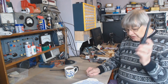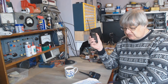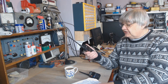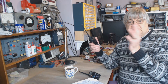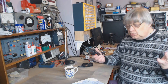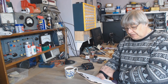So 136 and 465 MHz are resonant on the Baofeng. On my TYT radio - the more expensive one - this aerial is resonant on 143 MHz, so it's not bad for two meters, and 412 MHz. In between, if you want the marine band or PMR 446, the SWR is all over the place. But as someone pointed out, if your hand is near the aerial it's all going to change anyway, so that's sort of by the by - just out of interest.